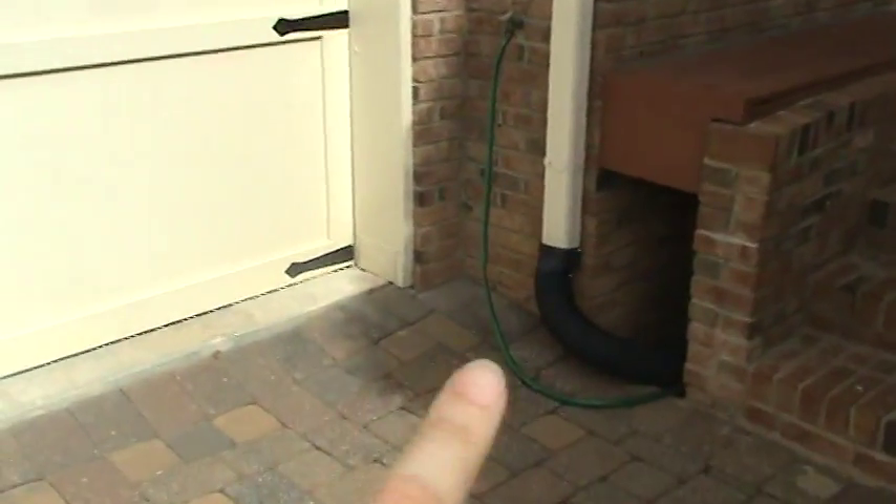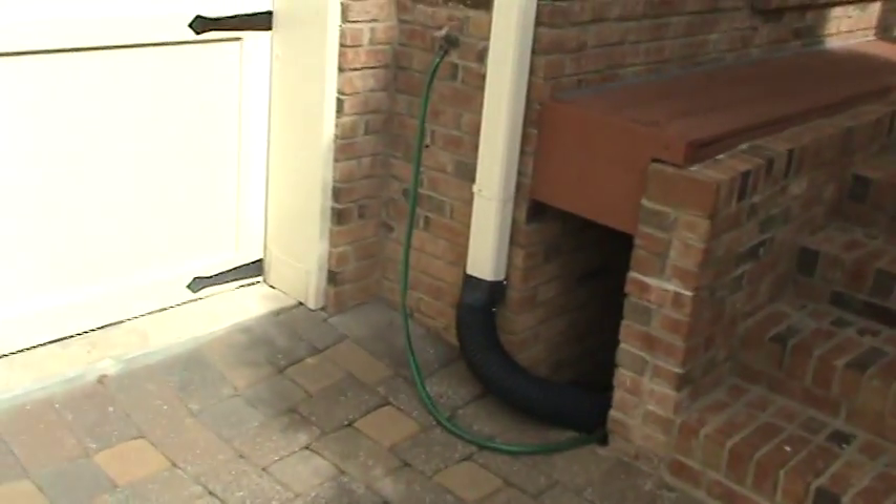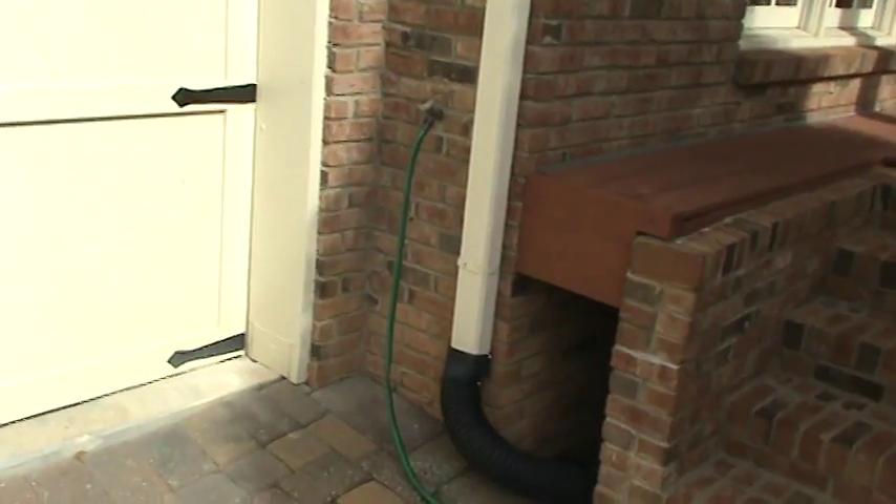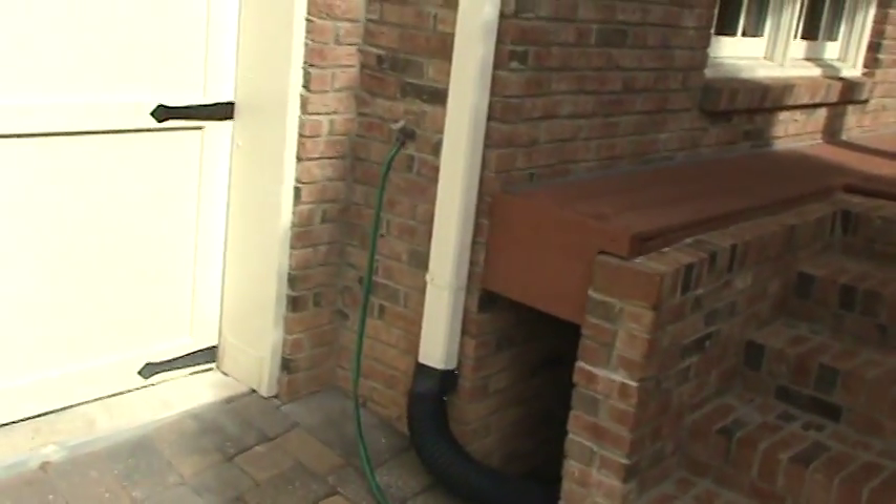On the right side of the garage door right here, this 2x10 is rotted out. I guess for the last inspection report when this fella bought the house, they pieced it in and that's the repair. So that all needs to be cut out with a nice angle cut and done properly.